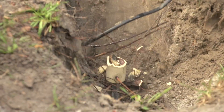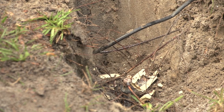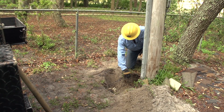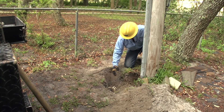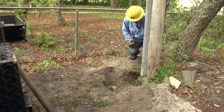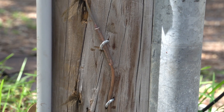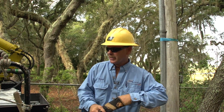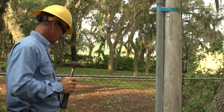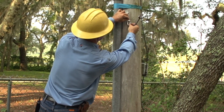We'll get to see what it looks like now — look at there, welded right to the rod. I was taught that lightning does not like curves. When you come down off the pole, I try to make a straight shot or a slow loop to the rod, not a big major turn, because you want lightning to go to that ground. Every pole that has a driven ground is marked with a G. We started out at 500 ohms — this G represents a driven ground under 25 ohms.